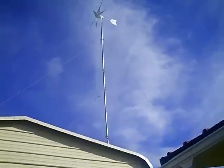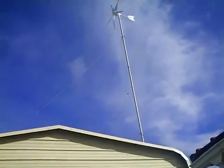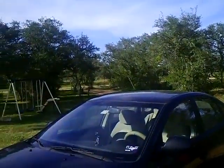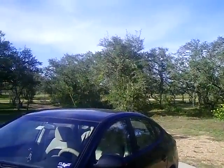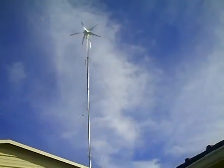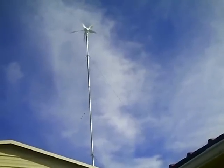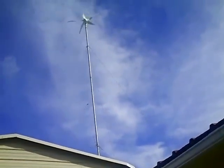As you can see, it's turning very nicely with hardly any wind at all — she does quite a good job. This is why I decided not to use a 24-volt charging system: at 24 volts right now I couldn't get a charge because it's turning too slow for the wind in my area. By dropping to 12 volts, I still get a little charge in light afternoon winds. Once we raise it another 20 feet, wind power will increase because I'll catch better airflow that I'm currently missing due to the height of the surrounding trees.